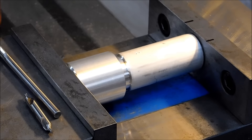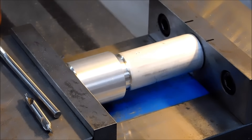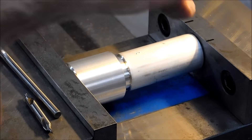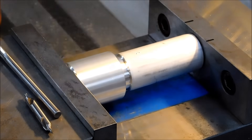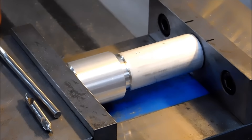With the arbor properly loaded and positioned in the vise, squeeze it with a great deal of pressure - really torque down on this thing. Let it sit for about 30 seconds to a minute, go get a cup of coffee, come back and squeeze it again without opening the vise. That way if the clutching material settles, you want it to settle really torqued. Squeeze it, walk away, come back and squeeze it again. Then let's drill a cross hole and pin it.